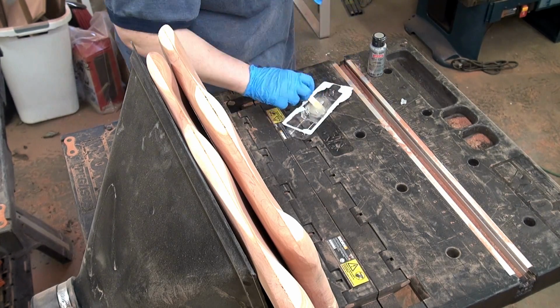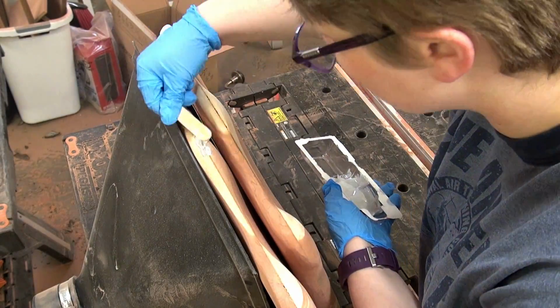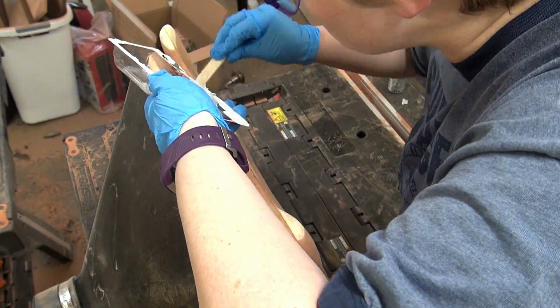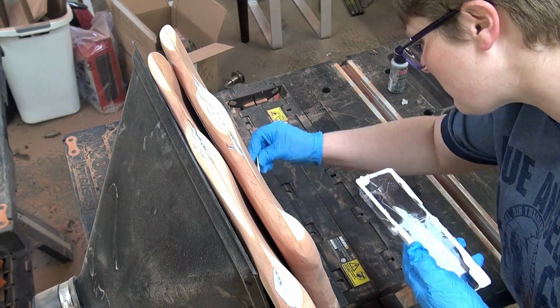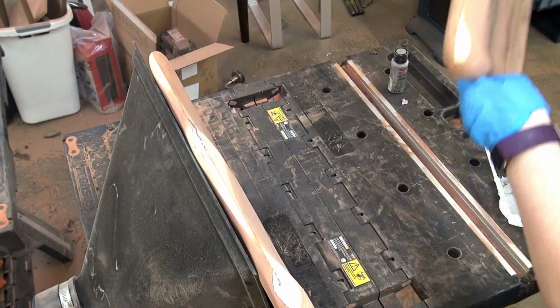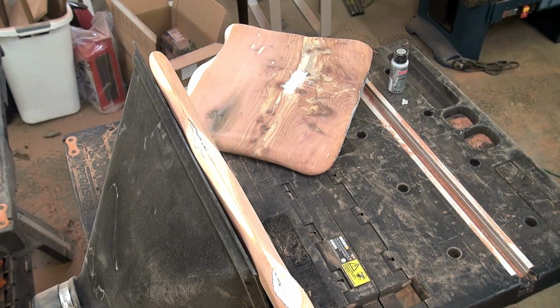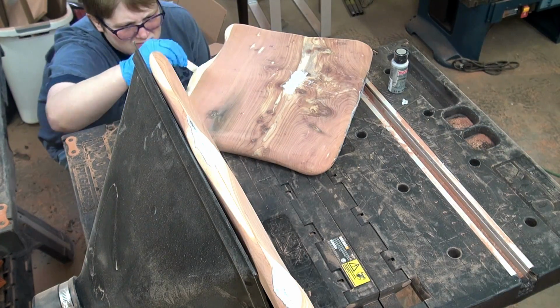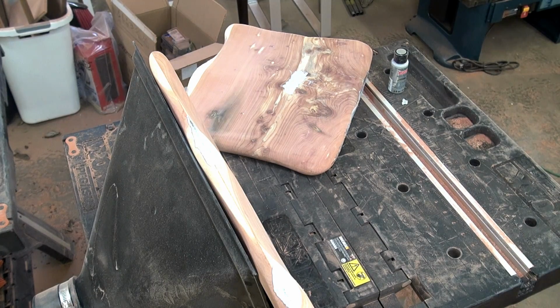And then after I had sanded down, unfortunately I did not get the cedar as flat for glue up as I had hoped, and so as I sanded and carved more away, there were a few gaps at the seams that did come through. So I'm just using some Gorilla Glue quick mix epoxy that again I added the paint to, just to fill in those little areas, and really you don't notice it in the finished product at all, which was what I was going for.